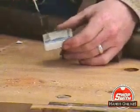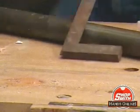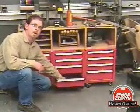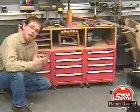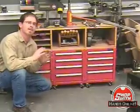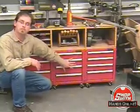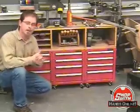What we're going to do is cut slices like that, and that will just open it right up. We're going to take it over here to our toolbox and put it in the bottom — just drop it in there and close it up. What it's doing is evaporating; the fumes are getting oils all over everything inside here — a very light film, not enough to make anything slippery. You want to make sure it is in an enclosed space so it keeps all that area and won't diffuse.